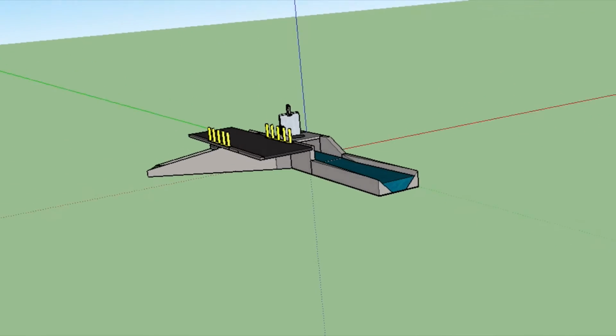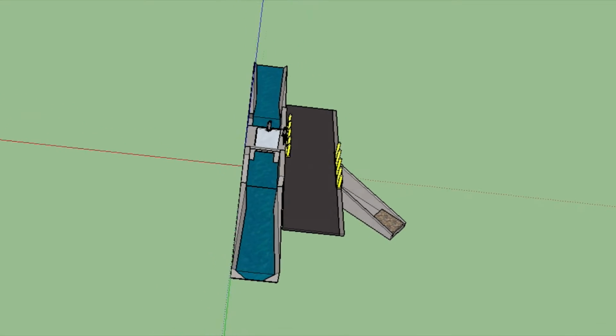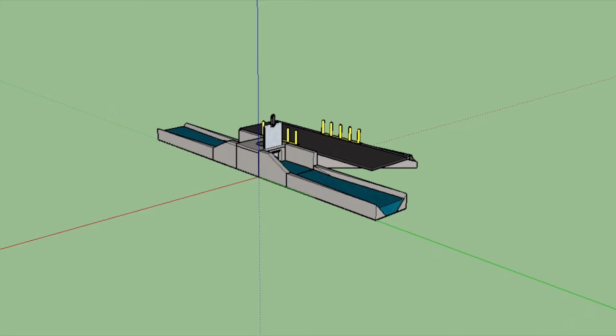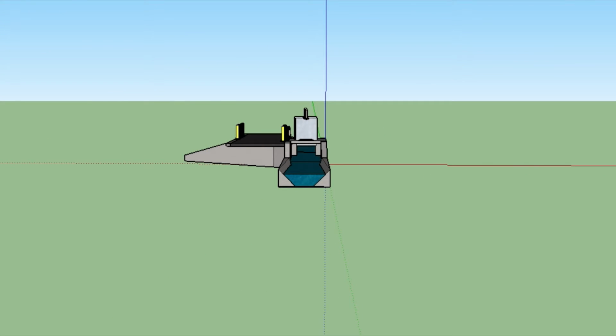So to elaborate on what Brian discussed, here's a 3D model of our channel diversion system. In this view, you'll notice the channel is in its dry weather or first flush position. The gates are positioned in such a way that the dry weather flows through the system down into Alvarado Creek as the channel was originally designed.